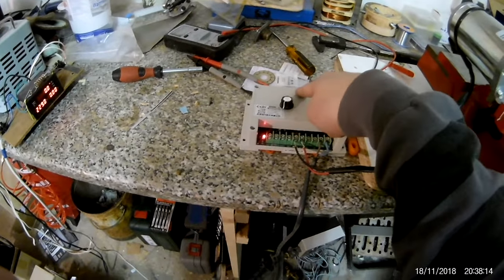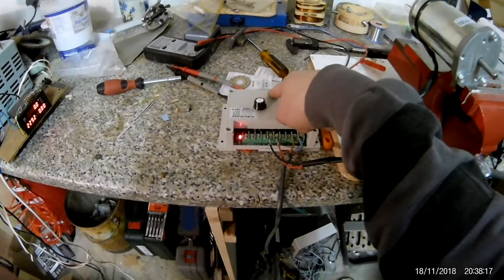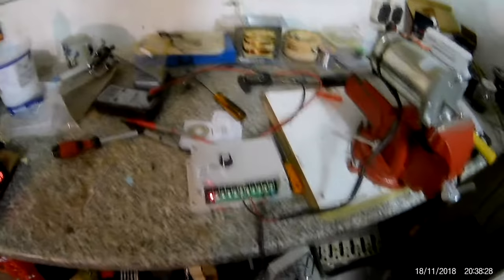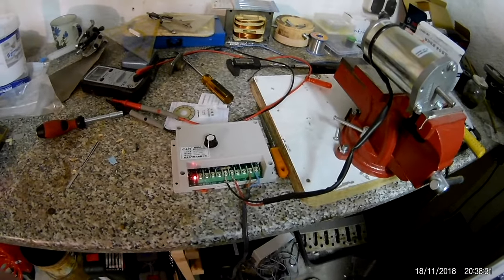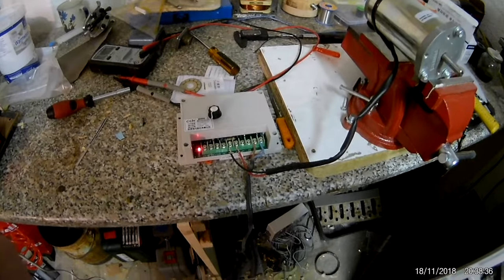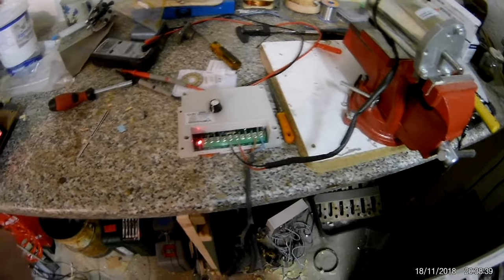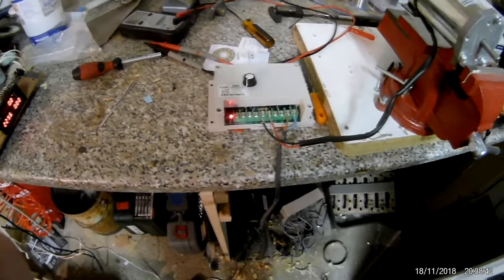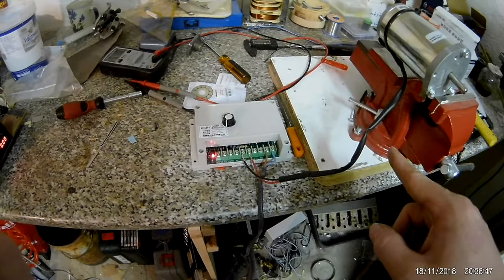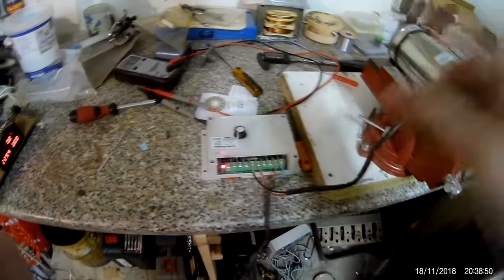And from the rectifier, it goes directly into two switching devices that are back here. Each of those switching devices is a thing called an SCR or thyristor. A thyristor is a silicon-controlled rectifier. It's basically a diode with a switch or a gate, so you can apply some power and it will turn on. The problem is it will not turn back off again unless the current reaches a certain low threshold. So in this case we have the sine wave jumping up and down because it's rectified, so it goes to a zero point every now and then.